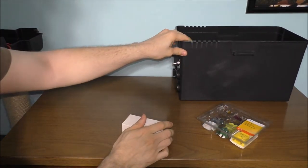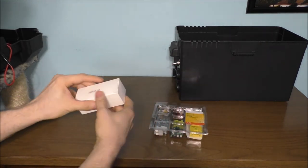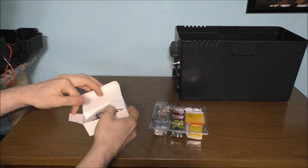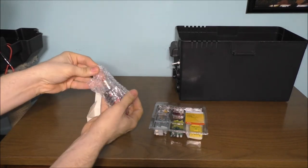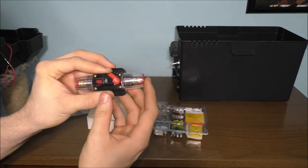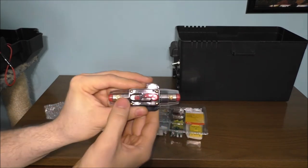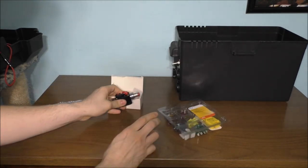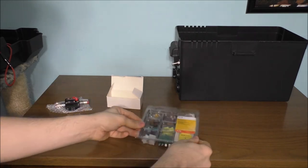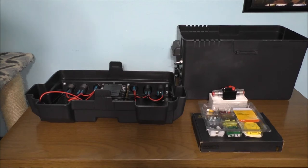Let's talk about this here for a minute. This is called a DC circuit breaker, and what's really nice is you bring your power wire in here and the outgoing wire here. This is only 20 amps as well, and we also have fuses right here. What's really nice about making your own and customizing your own battery backup system is you can design it however you choose.